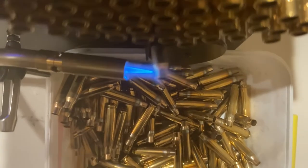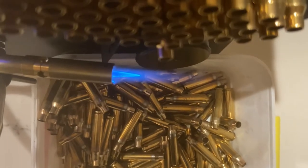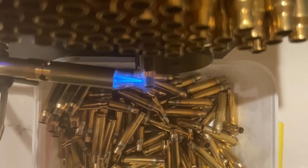It may spread so wide that it reaches the wheel. If you're annealing 762x39 or 300 Blackout — those are a lot shorter — imagine when you're nuking it, turning it up so high and it's spreading so far out sideways. You will burn the wheel. The flame not only goes above and below the brass, it also goes sideways. When you turn it up too high, see how far out it spreads to the side — that's what's burning your wheel.